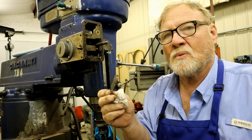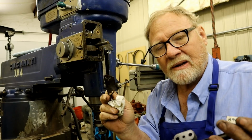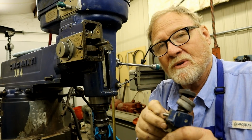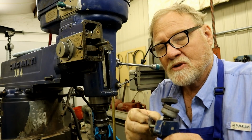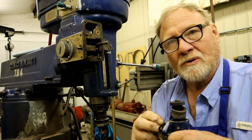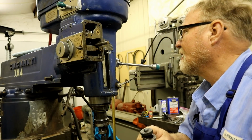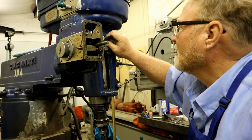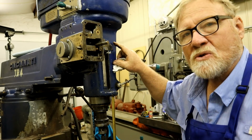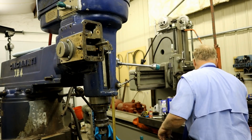And what I thought was a gasket, because it looks like a gasket from that side, is actually a shim, to shim this into proper spacing. So you don't want to lose that. We'll put that back in there. Like I said, I knew there wasn't any oil up there because the bearings are sealed in this machine. All right.